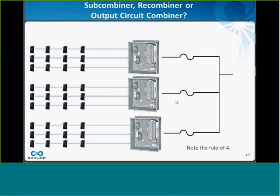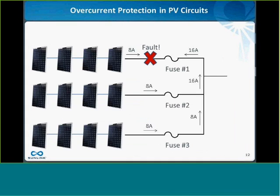But ideally, if you want it to be even safer and you want it to operate even on a day when it's not full sun, it'd be nice to have 4. Really, that is the safest design. And even then, consider this. I have multiple strings now. Let's say I have 4 more. So, okay, fine, this fuse is going to blow. This fault has not cleared on my roof, however, right? I could still have 8 amps feeding this fault, and basically all this blowing the fuse really does is two things. It prevents more than 15 amps from going down my conductor this way, which could be enough to melt my conductor.